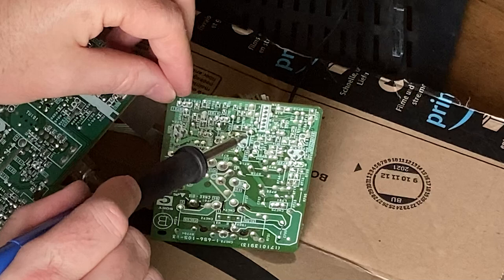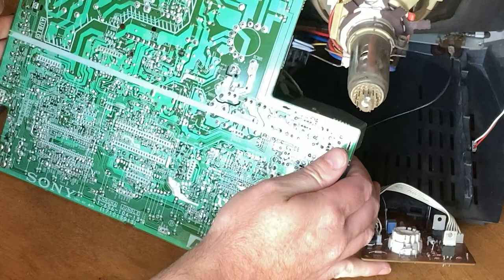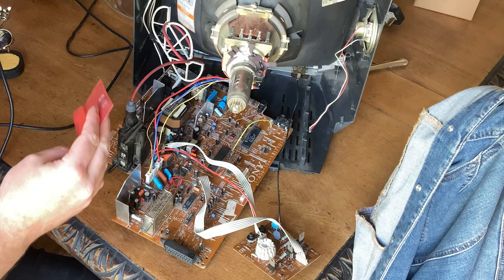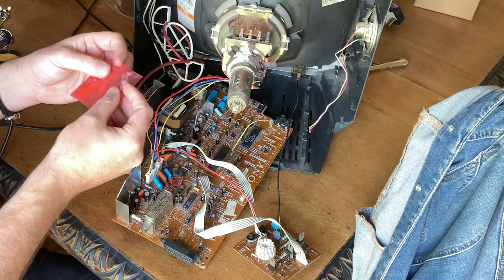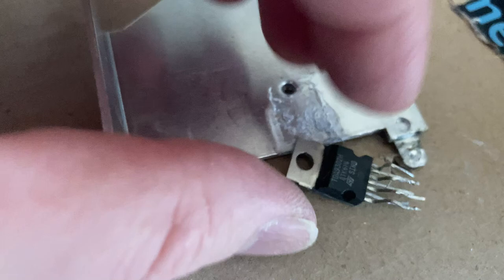It's well worth going around and checking all your joints first. The board was clean with no leaking capacitors, which meant I had to buy the unit — the main IC, I think it's the 501. I purchased it online; there's a link below. This goes back to having the actual manual, which tells you the part numbers you need to buy. Always search for the specific manual for your particular CRT, and then you know exactly which parts to order.